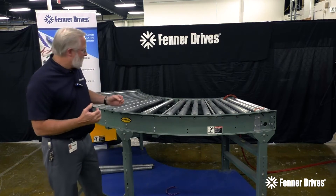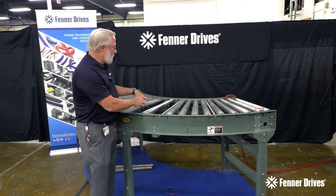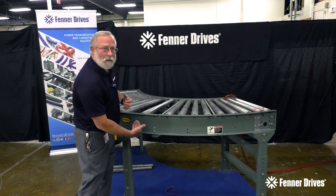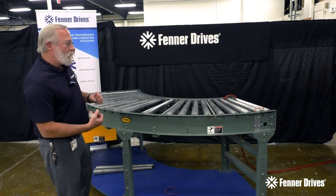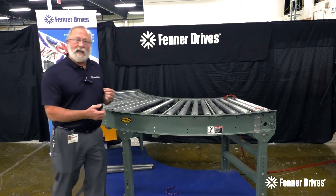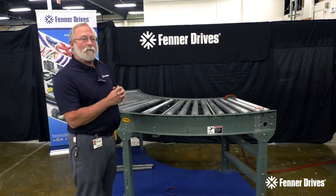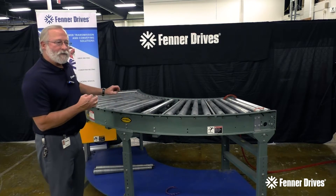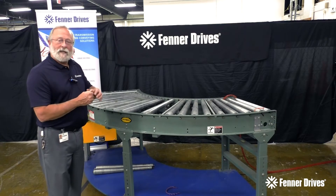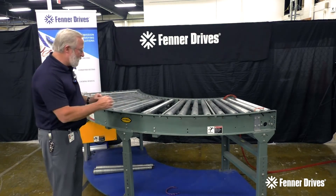Now, what I've done is taken off three of the rollers because that's going to allow me access to the take-up — we're going to stretch the belt and pull it right over the take-up. We've also disconnected the drive because I'm pulling the belt through and it has to freewheel. If you're unable to do that, loosen up your take-up enough so that you can pop the rubber belt off the drive pulley, then pull it around the drive shaft and put it back on after you've sized the link belt. Those are preparations we've already made.